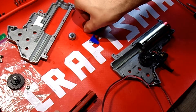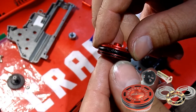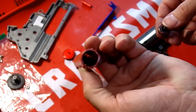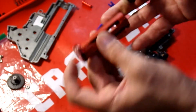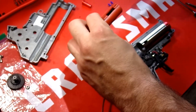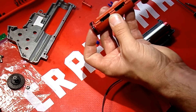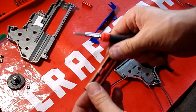Got Max's piston head. It's got a double ring — there's a big one you can see and a small one right at the top that's really tough to see. It comes with all the spacers you need. You put these through here, and then the bottom side is where it gets screwed in — this just sits right on top. Once it's in through the hole, get the screw in, push it up, get it lined up. Once the screw grabs, start to tighten it and just get it snug. You don't need to over-tighten it.